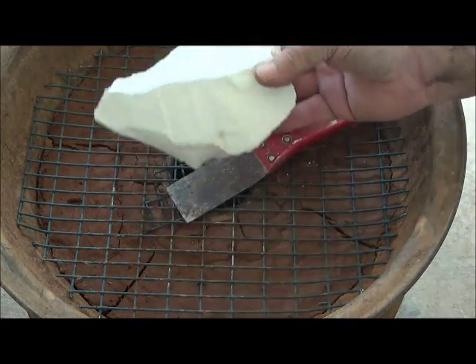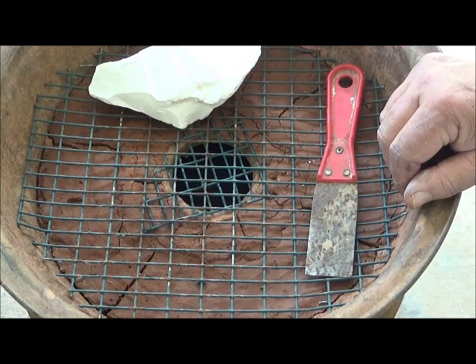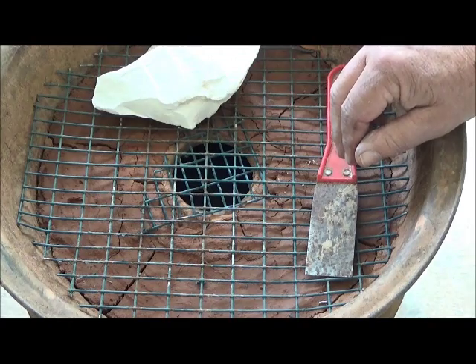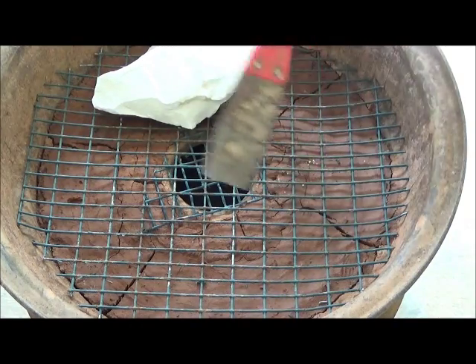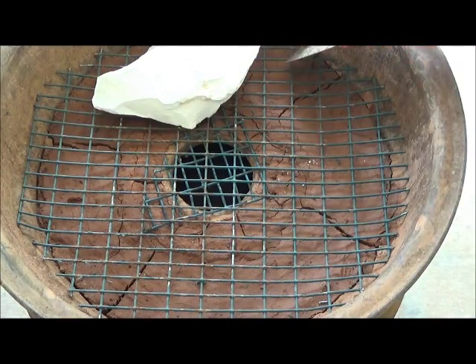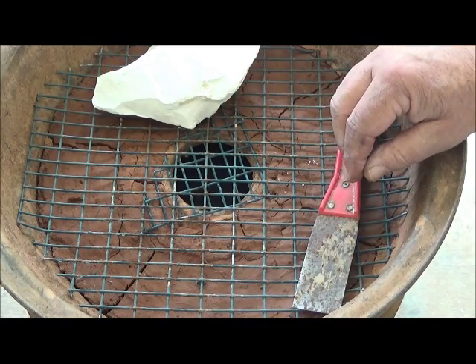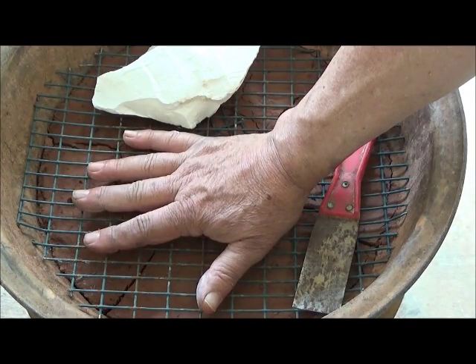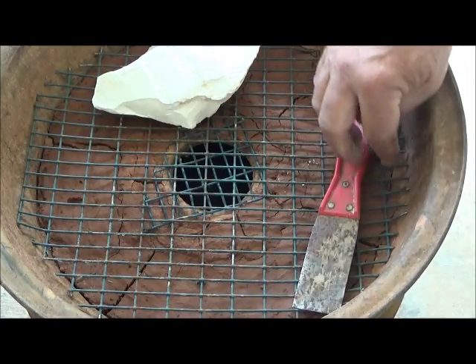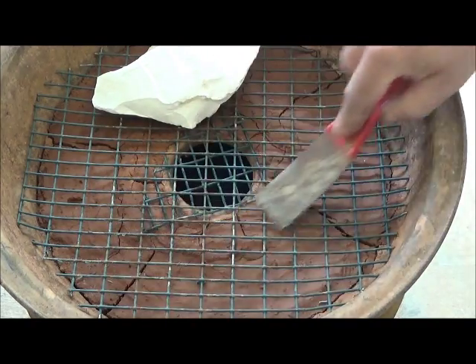Now this is kaolin clay — our white clay — and that's a pretty good kaolin by the way. What we are going to do is take this clay, mix it with some dry sand and make another mud, and force it down through these cracks after they have completely dried. We will know they are dry when they turn about this color — this is maximum dry here. After that, we will take more dry sand and just pour sand over the bottom, including the metal grate. That will fill all of these holes further, as well as protect the clay from abrasion from any metal tools.